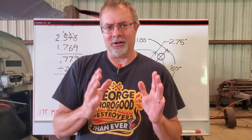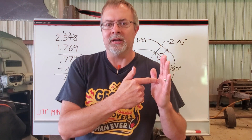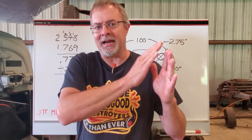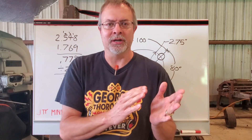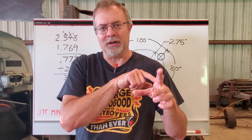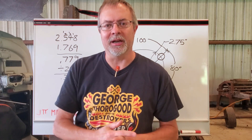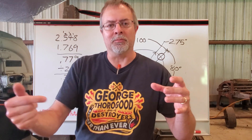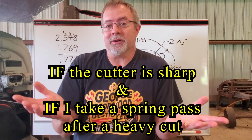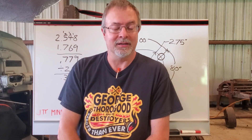The only thing you have to watch is I've got all of the scale set up so that it comes to zero on the way with the spindle traveling out. There's a little bit of backlash — 10 or 15 thousandths backlash on the vernier if I'm running the scale in. So I can't just pick an absolute number and say I'm going to mill down to this. What I have to do is get close, take a reading with calipers or micrometers, and then go incrementally from that — it's very accurate to take a set amount off and come down to a specific diameter. But for IDs, I can dial in a number from zero coming out and it is basically spot on. You've got to pick one way to set that thing up, otherwise I'd be re-zeroing the head each time I wanted to do an ID and OD.